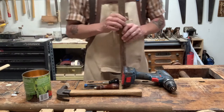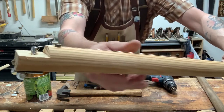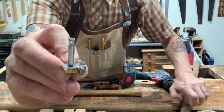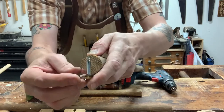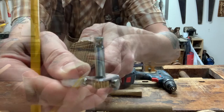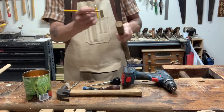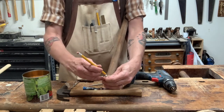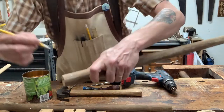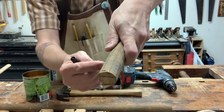The next step is to rip the tuner notch — this is where the tuner goes through the stick and the string bends down to it. I'm going to take my guitar tuner; you'll see it has a little hole and a little waist right there. I position that on the stick and make a line, then project that line back on both sides about the length of the screw plate of the tuner. Now I have my line projected back with a line drawn across the top.